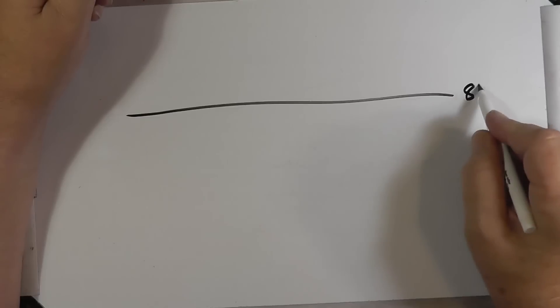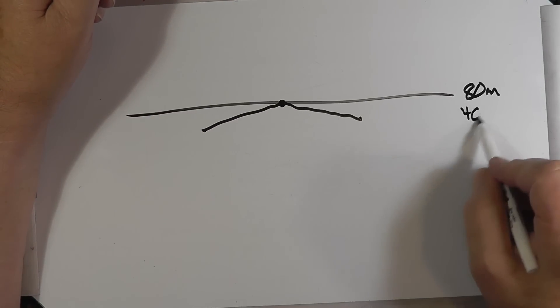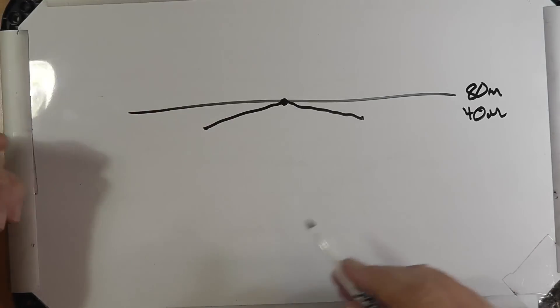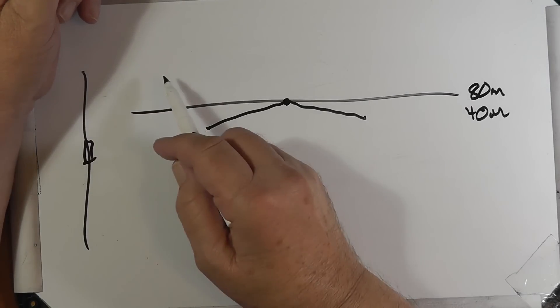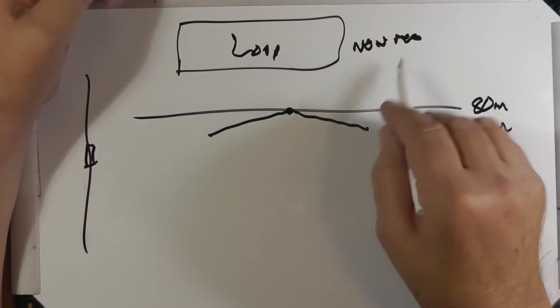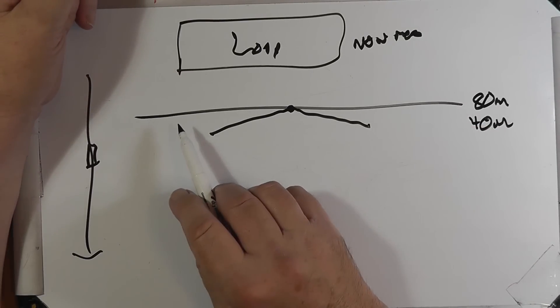Let's show how that would work with a fan dipole. So what we have here is an 80-meter dipole, cut in the center. Now, if we were to add to that a 40-meter dipole fed from the same point, then you have what's called a fan dipole. A fan dipole can be used on multiple bands. There are many kinds of multi-band antennas — verticals with a trap in the middle, multi-band loops that work on multiple bands but need tuning, and non-resonant antennas resonated by an antenna tuner. There are many different ways of doing verticals.